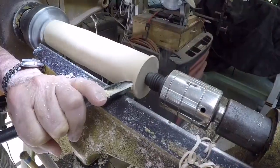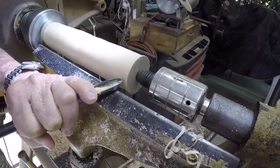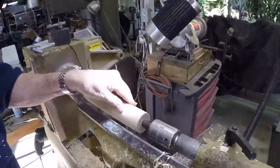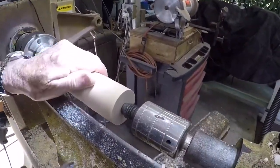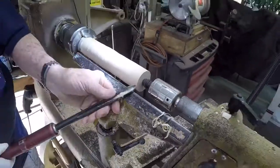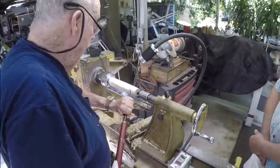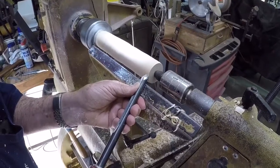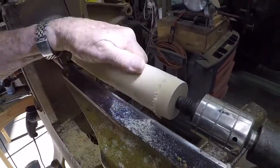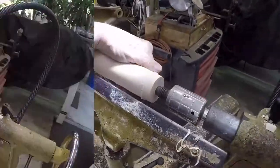Come off the end of a piece of wood like we're going to do right now. This is fairly hard wood and we don't have a problem, but you can get tear-out right at the end there — that's where your tear-out will happen. That's because you're going off into air — it's unsupported wood. If you come back, that's nice, that's nice. That's the 320-grit sanding finish you get on that.